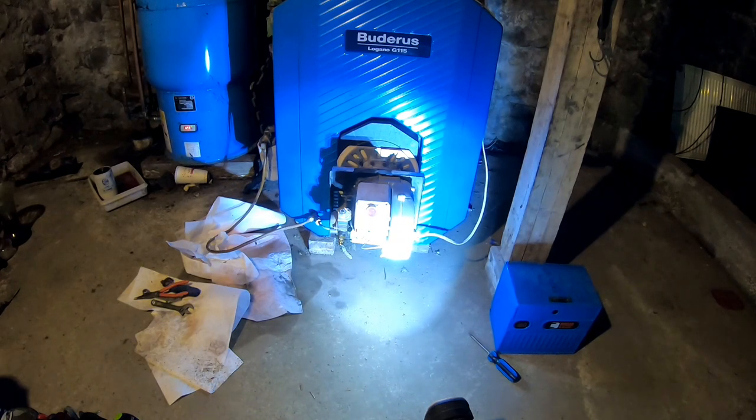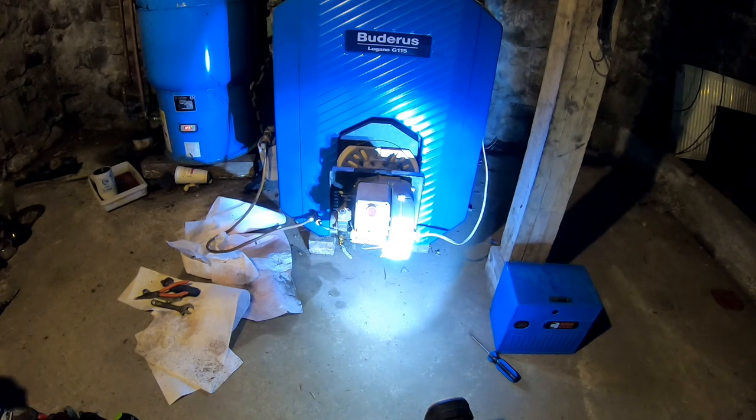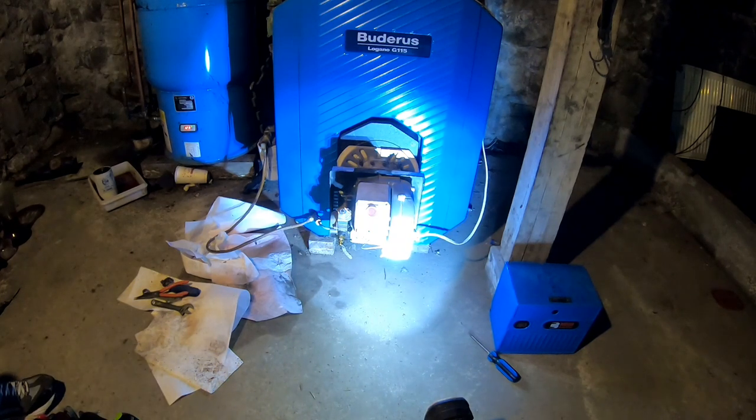It's probably about 90 seconds before you can push that button again. You don't want to be pushing the button a lot — if it's pumping air and you're not getting any spark and you keep hitting that button, you're going to fill that chamber with oil and get a minor explosion. Now, it seems like the nozzle is plugged to me. If the filters were dirty into the pump and out the tube, that nozzle could be clogged.